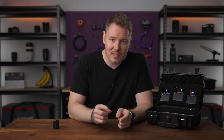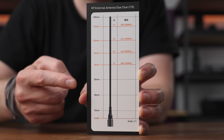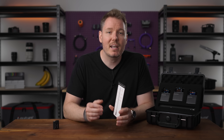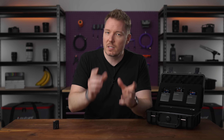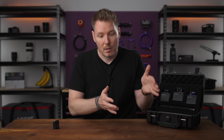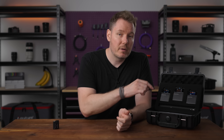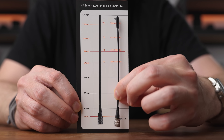Optimal antenna length is another fascinating topic worthy of a video of its own. But something handy that Saramonic does with the K9 is include a one-to-one scale antenna size diagram for trimming your antenna down to the optimal size for the frequency you plan to use in your region. An antenna that's the right size — also known as a tuned antenna — is one that resonates with the incoming radio waves. This is done by calculating the wavelength of that specific frequency, then making an antenna that's the same length, half the length, or a quarter of the length. The included antennas for the K9 are quarter-wave antennas, meaning your antenna will be one quarter of the length of the wave you're trying to receive and should be optimally tuned for that signal.